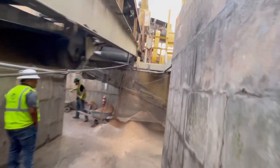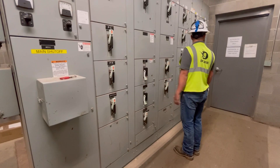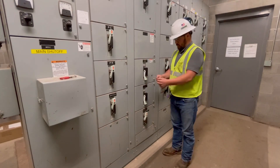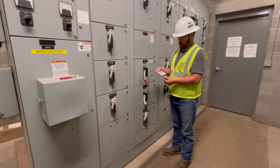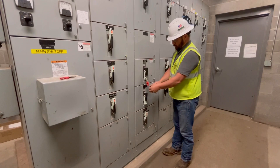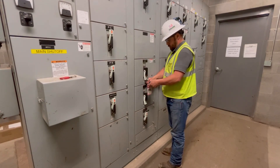Let's take a look at how to properly lockout tagout and also turn off breakers the proper way. When switching off a breaker, always remember to stand to the side and face away. When you go to put your lock onto the breaker, make sure that you use a hasp. This makes it so that more than one person can connect to that same breaker at a time. Always make sure your lock is accompanied with a tag with your name clearly written on it.